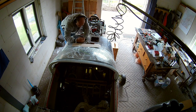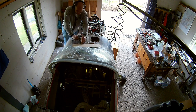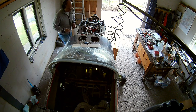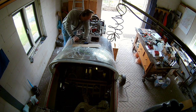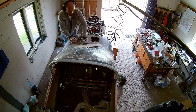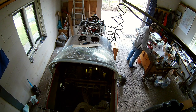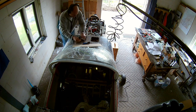From the analysis with Jacob, I could figure out that the ECU was set up correctly and that the RS-232 interface was giving the correct measurements. But still, the CAN bus didn't give me the correct settings on the MGL EFIS and AMS. So I had to figure out why that was the case, and I found that the problem was in the CAN bus connection from the ECU to the ULP RDAC, which is a special MGL RDAC designed for ULPower engines. In the drawing of that connection, well, you can buy a pre-built wiring harness, or you can build your own.